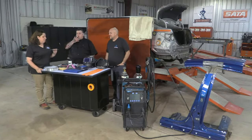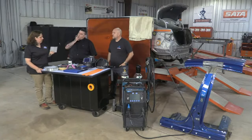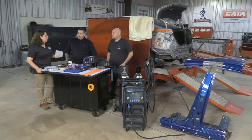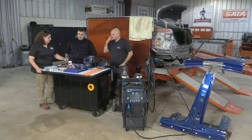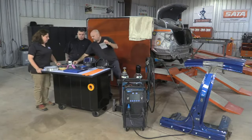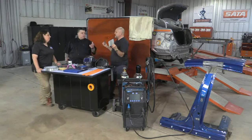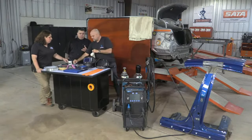It tells me that you might have just had I-CAR come in and do your weld testing, but this probably tells me that you're going to butcher a car, because this material is nowhere near what this material is. I mean, this is like 16 gauge. I can't go from the 16 gauge material to this 22 gauge material with the same setting. You're talking 1 millimeter to 0.8, 0.9 millimeter.